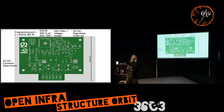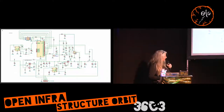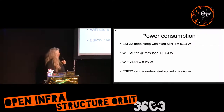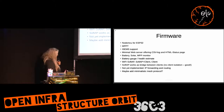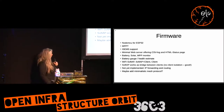If you want to save some power, there is an option to do so. The result: at full load it's 540 milliwatts, or 0.54 watts. As a client it's a quarter of a watt, and you can still undervolt to bring that power demand down further. NodeMCU is the default firmware; you can change it to whatever you wish, but then you'd have to reimplement the monitoring functionality I'm providing in your preferred tool.